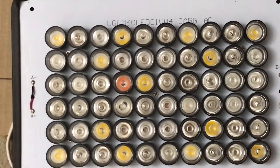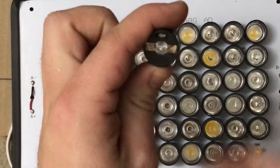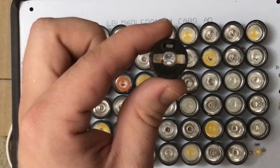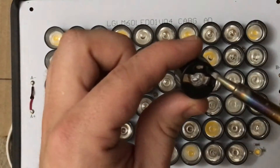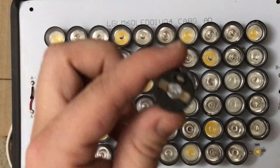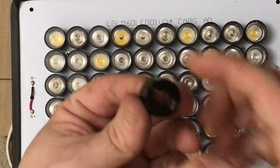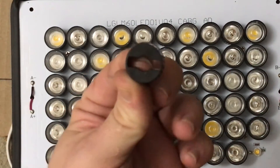Zooming in so you'll be able to see the panel up close. Take off an LED holder — this is what your lens holder looks like. Now this is with it being modified. When you order your lenses and they come in, it's not going to have this little groove in it right here. I actually took a soldering iron and melted this out, then trimmed it with a razor. Your stock ones will look like this, so you will need to modify this.